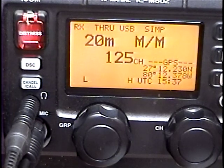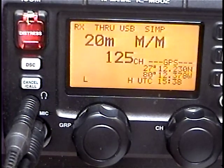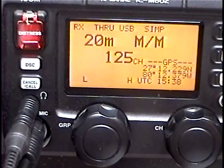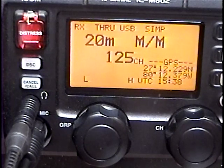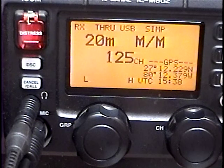That is the 8 megahertz international distress and safety calling frequency. Any transmission will take about 35 seconds, and then it will wait about three and a half minutes while the DSC receiver continues scanning the six international frequencies. You're going to hear static out of the radio because your volume will be turned up, and you'll be listening to the 8 megahertz channel 8291. After about three and a half minutes, if there's no response, the radio will send out another distress message. It'll do this five times for you. You don't have to do anything other than pressing that one button once. That's why they call it a simple distress message — it only operates on the 8 megahertz band.